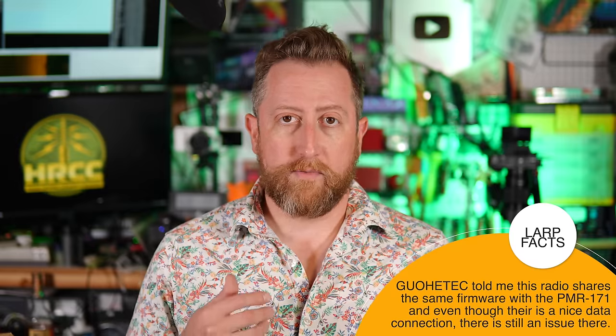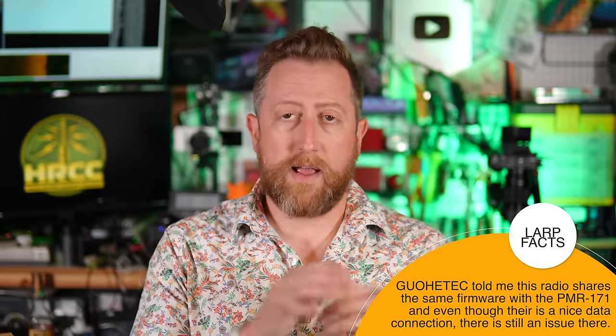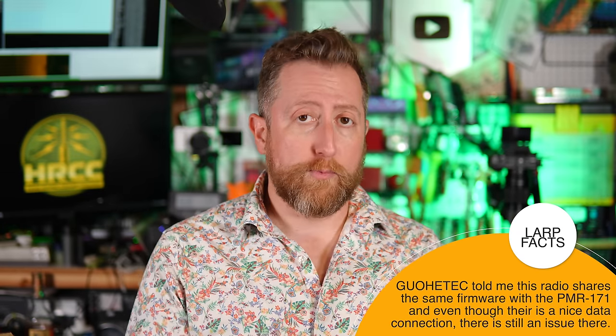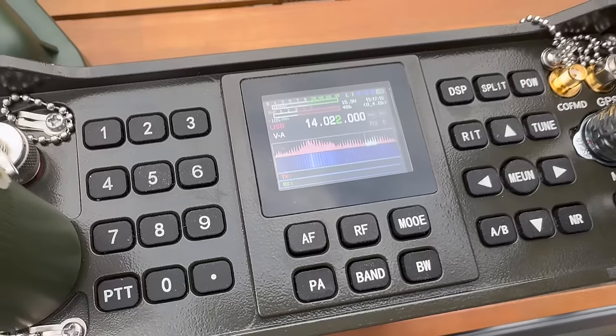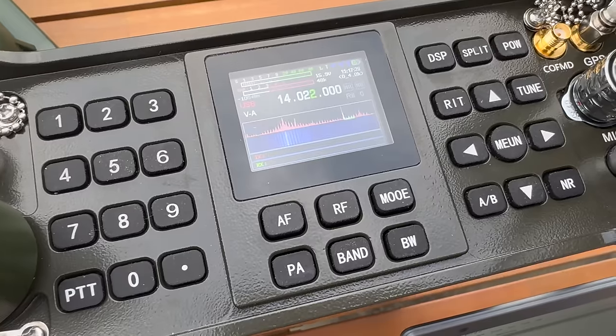or that you want a waterproof box where you can just do single sideband, because, spoiler alert, I tried to use this on FT8, and I found, regardless of which laptop I used, when I plugged a USB into the radio and the computer, copious amounts of noise on the radio itself. I have a choke for common mode, and we've got a heap of noise. Let me unplug it. Goes away.